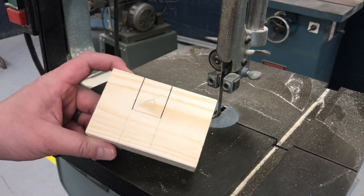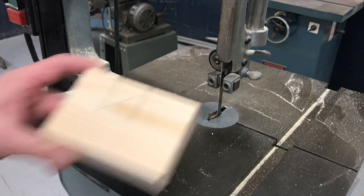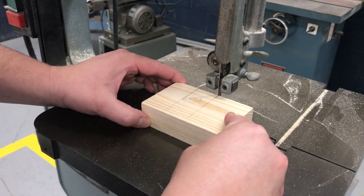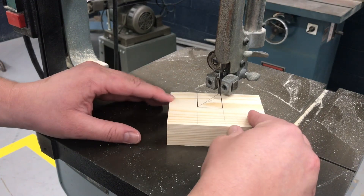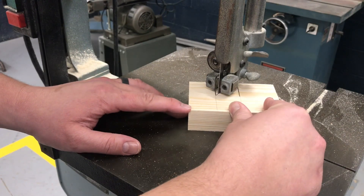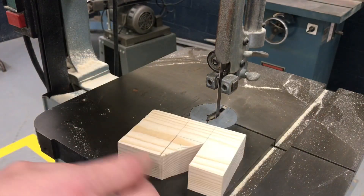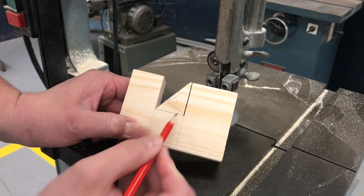Here's what I have cut so far. Now I'm going to go from up there and try to hit down into this corner. I start out flat at first to make a small indentation at the top — that makes it easier for the blade to grip where I'm going. I slow down a lot near the bottom because I don't want to cut into my edge. It just breaks free and I back it out. Use the board to get your scrap pieces out — don't use your finger. Now I'm going to bring my blade all the way down here and cut into this a little bit.